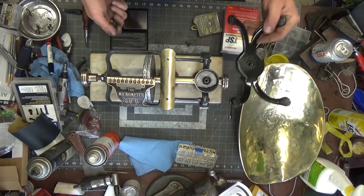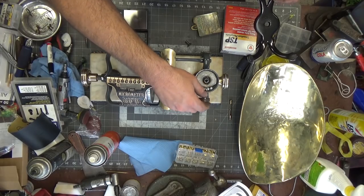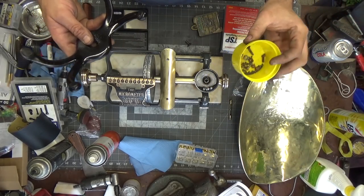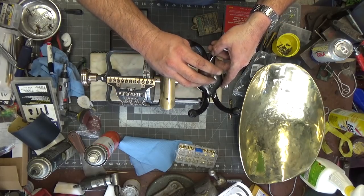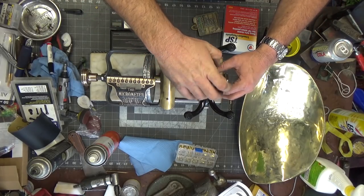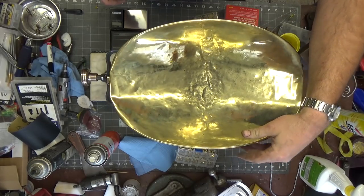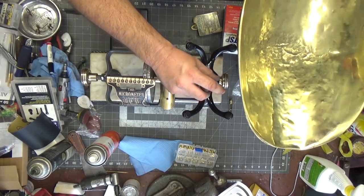If you remember what I had before, there's already a piece of lead in here. It looks like they might just fit. What they had done is used some steel shot for the handle and then threw in just a bunch of screws, and those were starting to rust. The rust is going to hold water and change the weight — not significantly, but it's just not a good idea. So I'm going to use lead because it's sort of inert and it's not going to rust. That should calibrate the scale and not have any capacity to oxidize, rust, and stain the marble any more than it already is. The scale can be oriented a couple different ways — sideways, but then it inhibits your ability to read the scale. So I'm going to keep it like this and not bother adding the shot back to the handle.